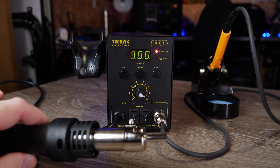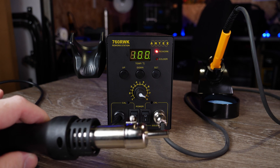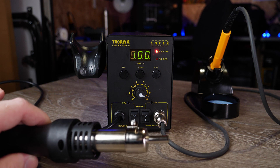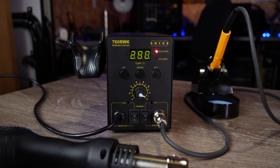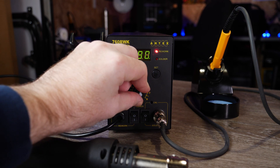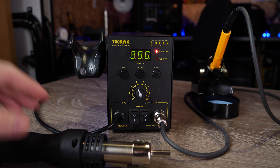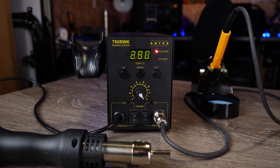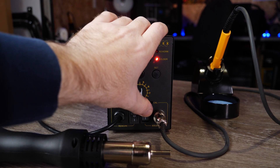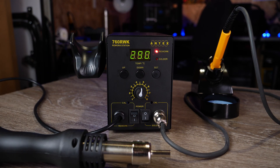The rework station has a temperature range of 100°C up to 500°C maximum, and in the middle you have the fan speed control as well. I currently have the temperature at 100, so I'm going to increase that to 290. In the middle we have the ability to control the speed of the fan in the handle — you can hear that changing as I adjust the knob in the centre. If I want to jump back to the soldering iron to set the temperature, I simply press reset and it jumps back over to that side. You can use both sides of the unit at the same time, but most of the time you'll just use one, and when you switch the other side off it will automatically switch the control over to the active one.